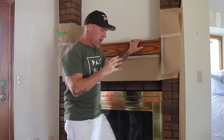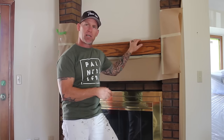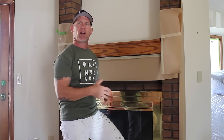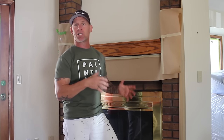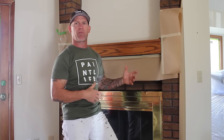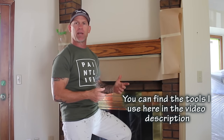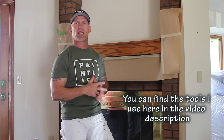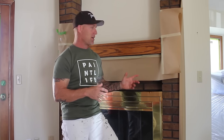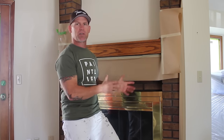When it comes to painting or staining this fireplace, we're going to use a solid color stain so you don't have to prime it because it's self-priming. We're just going to use a sprayer to get the product on fast. You can brush and roll it, but spraying is quicker. We'll keep spraying and back brushing — spray it, back brush it, let it dry, then look for spots you missed. There are basically an infinite number of angles, so you keep spraying at different angles and come back to redo it. We'll probably do it about five times before it's completely covered. If you try to paint with regular paint on brick, you'd have to prime it first. When you're using a porous surface like this, just use a solid color stain.